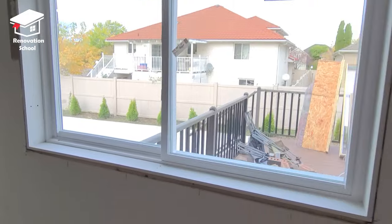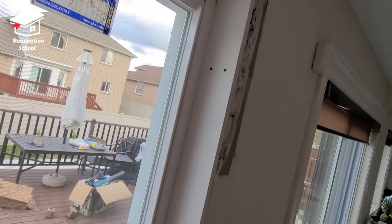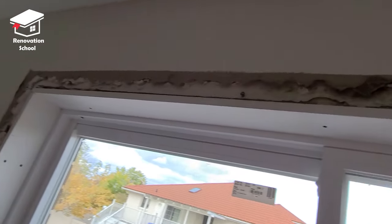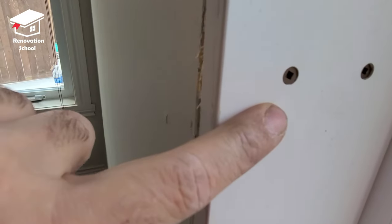This is how the window looks as of this minute. This is the location of the screws that I put in and you can see how many I put on. It's very important to keep checking this to make sure it's level and plumb — it's the most important part of this whole project. If it's not true, level and plumb you're gonna run into many issues later on.